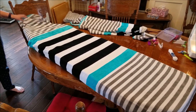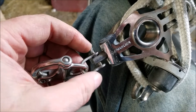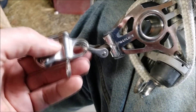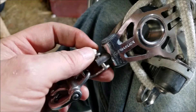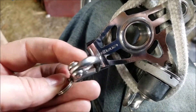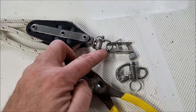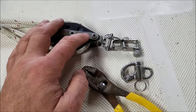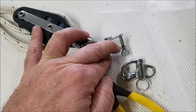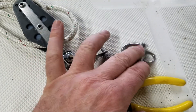It's going to look great. This little pin here I have lost so many times and it takes a while to install. To speed this up I've added the snap shackle from the speedy rigging kit from Bluewater Yachts and tightened it down with pliers. I might even undo it and put some 5200 in there and tighten it back down - this way it will be fast to pull and clip on and speed up rigging time. The next piece is on the boom vang; the last one I did was the main sheet traveler. This clips onto a little tab on the base of the mast, and swapping to the snap shackle will make it faster.